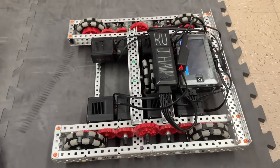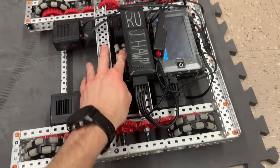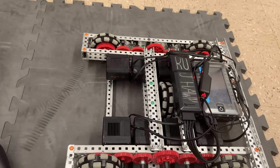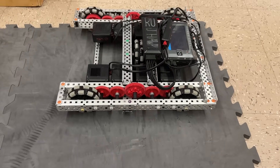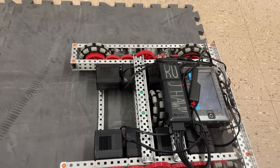This is similar to drives like an X-drive or a mecanum drive, however since you only have one motor powering your horizontal movement, it's going to be either much slower or have much less torque. Since this is like an 8-motor drivetrain, it gets really fast acceleration, but this center wheel only has one motor. You'll notice it still has not the worst acceleration ever.